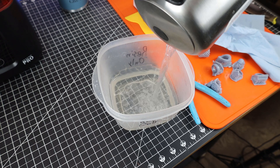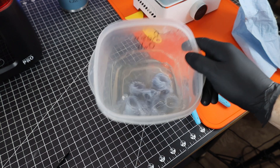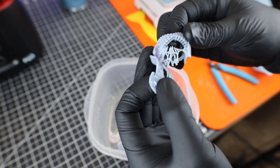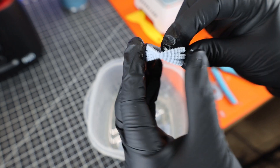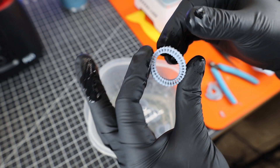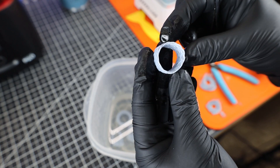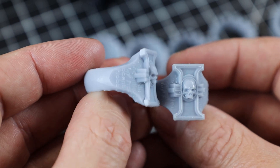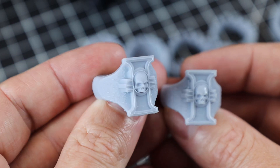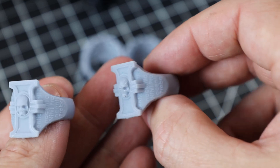I'm going to use containers with some hot water to help get the supports off, so we can check out the details. Keeping them in hot water for a bit lets you just pull the supports right off, so there's very minimal cleanup. Overall, besides the back of one ring, it came out pretty good. This resin is also semi-flexible, especially when warm, and I'm definitely going to use it more to see what else I can do with it. As you can see with the octopus ring, it can print smaller parts with extremely high detail. This printer uses a 4K display, so you get really good details and sharp edges like on these inquisitor rings. It should work for whatever you throw at it, as long as you have the proper settings for your resin.